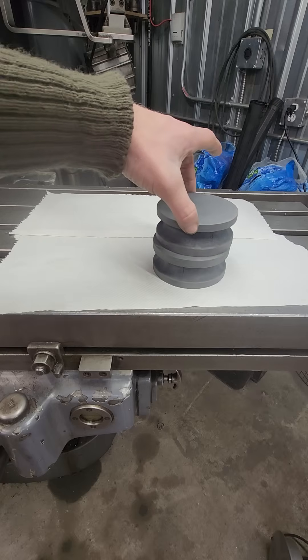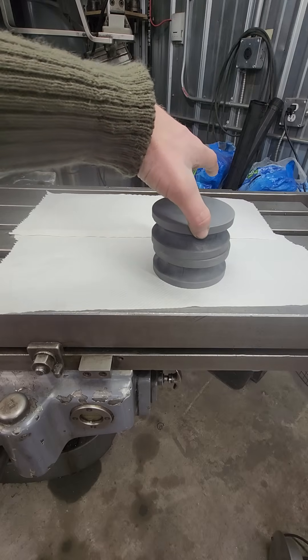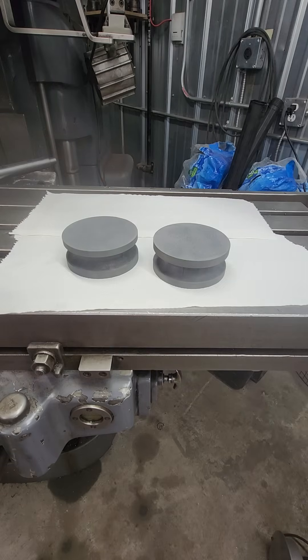That's the whole point of this argument. These are every bit as good — I've tested them. I tested them on a couple of parallels and the bed of our new lathe that's nice and clean, and these behave exactly the same as any of the surface ground stones I've ever used in the past. Anyways, I hope people found that helpful, and I hope people don't take this video the wrong way — but there you have it. Lapped stones are every bit the equal of the precision ground stones, and they are a lot more obtainable for the average person.